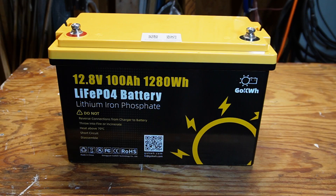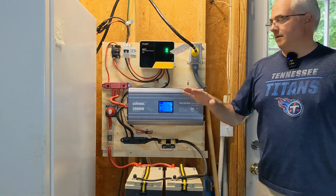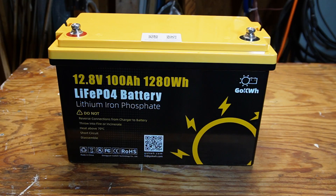This seems to be a good battery. I'm not an expert on batteries by any means, but I believe I put it through proper testing and looked inside. It's much better than before when they were using packing foam instead of high-density foam — it feels really solid and nothing was loose. It's over capacity at 105 amp hours, and it didn't get hot when maxed out at just over 100 amps for five minutes. With Bluetooth, this is excellent value — with the discount code in the description, available for about four more weeks, you can get this battery for $259, which works out to around 20 cents per watt hour. I think that's excellent value.